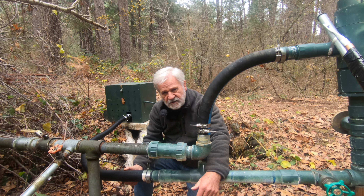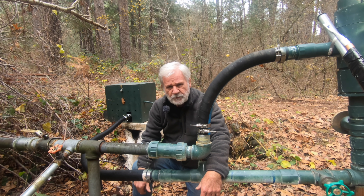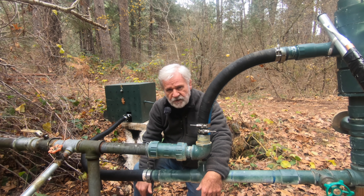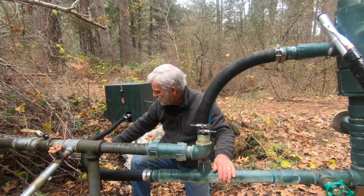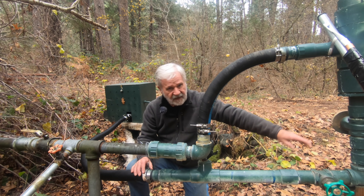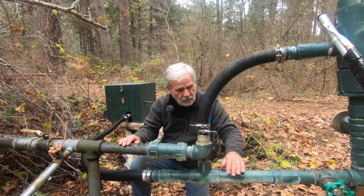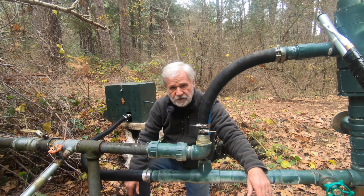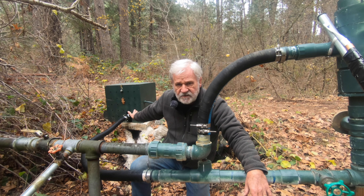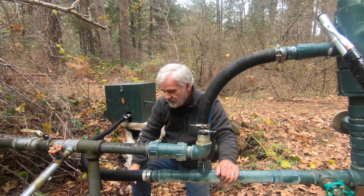Okay, we're ready to try the system out. I'm at the bottom of the hill now — it's been a few days. We've had some rain and it looks like we're going to get some more, which means our little spring is producing enough water that we can start producing hydroelectricity using our micro hydro unit behind me. The delivery for that is this black pipe in the foreground, which connects to the main delivery pipe. The pipe above it delivers water to the house. We'll turn on the water and make sure our charge controllers and breakers are on in the utility shed, because a micro hydro unit needs somewhere to send its power — it'll burn everything out if you don't have the switches on before you start the water. We've done that, so I think we're ready to go.